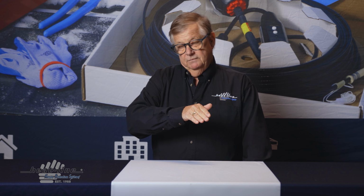In a drainback system, we have that valve on top, and it allows air to come inside, and it allows that drain pipe to drain all the way back to the water pump. At the water pump, there's usually a hole in the pipe just above the pump so that it can bleed out and evacuate. The idea behind the system is that if there's no water in that pipe, it can't freeze and it can't cause a problem, no matter what the temperature. And in some cases, that's good.